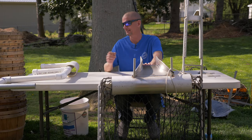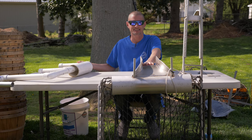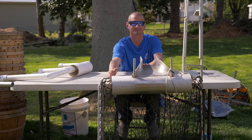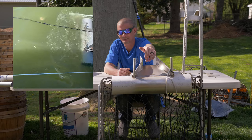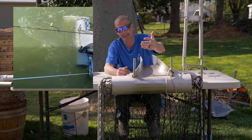The last piece of equipment is the auto dipper. Similar to the prop stick, it is basically a prop stick but with a net or cage underneath. The crabs fall in — as the snoods fall and hit it, the crabs get spooked and drop, and you're moving forward, so the forward momentum causes them to swim into the net.